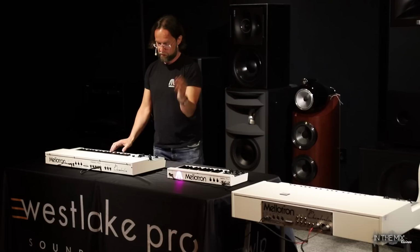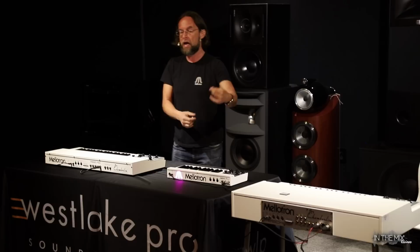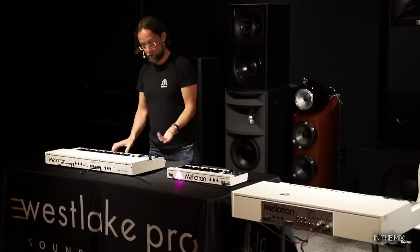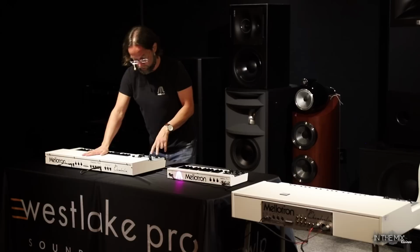This is something I introduced on the Mark VI Mellotron, that the motor can go down to half speed. We have a retrofit motor control for the 400, because as I was mentioning, those motor controls are really horrible. So we made a remake of what they did back in the 70s, and I added the two speed feature, so you can have a 400 with a half speed switch, and that got very popular. So we put that in the Mark VI, and then into this instrument also. But none of the original Mellotrons had this. And then of course it has the pitch knob as the Mellotrons do, and the direct output is not influenced by the tone and volume. It's just straight out from A or B, so to say.